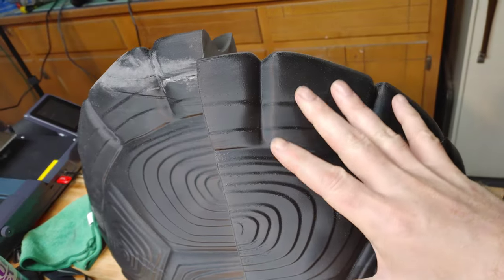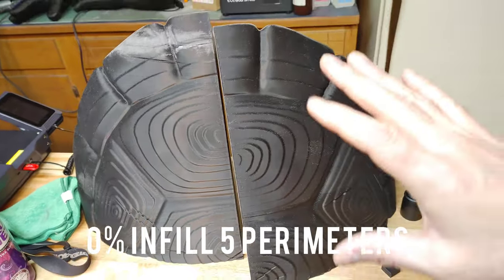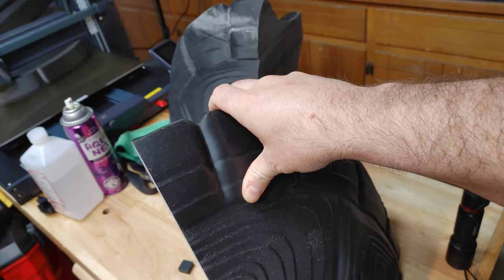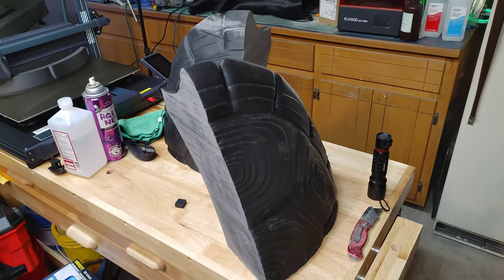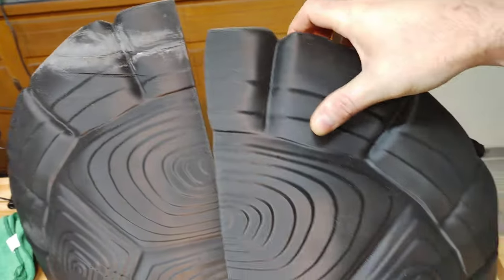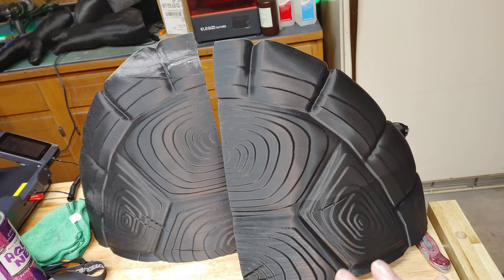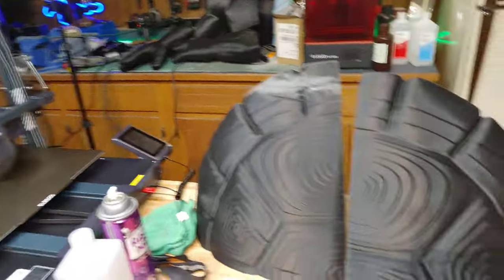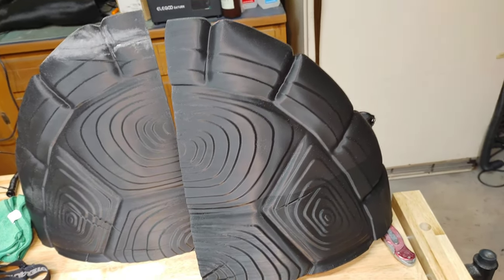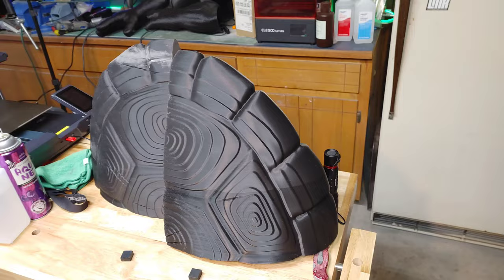I also printed this hollow. This doesn't actually have infill - it has about five perimeters and it's hollow inside. Because if I actually printed these pieces with infill it would have taken days - like six or seven day prints. Without infill I was able to cut down the majority of these pieces to about two to three days on the CR-10 Max and the Neptune 3 Max. On the Neptune 4, hollowed, I probably could have got it down to about a day. So if you're printing this turtle shell, print it hollow - you don't really need the infill, especially if you're just displaying it or making a mold.